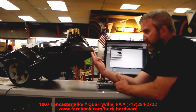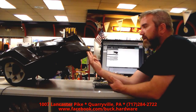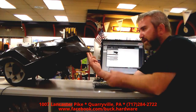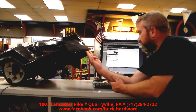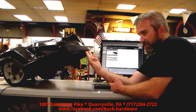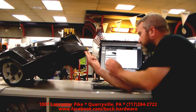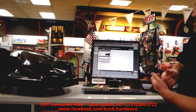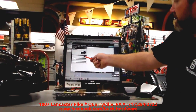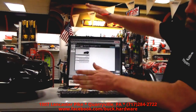Twenty-four degrees, as some of you have asked. For those who ask whether this machine can handle a hill — yes, it can. It can handle an incline up to forty-five or forty-six percent, as far as coming down the hill to the boundary wire and stopping. So that's forty-five percent, which is a twenty-four degree incline — you can see twenty-four degrees right there on the screen. We have this sitting here flat, and if you want, we can recalibrate the tilt sensor to let it know this is what flat is.